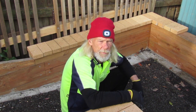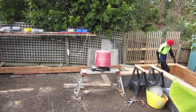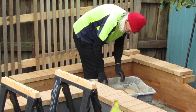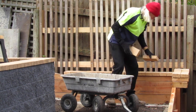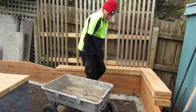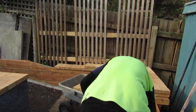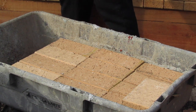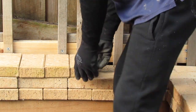We're going to need 120 of these, probably four loads. Part of keeping organised on your job site is to stack your materials in a convenient, close-by position to where you're going to use them. In this particular case we have this seat we put on the corner, so I'm using that as a place to store all these bricks. There's enough room for the amount of bricks we need for this pathway, so we're going to stack them up a few courses right here and they'll be really convenient when it comes to laying them.